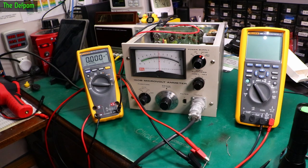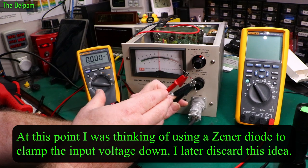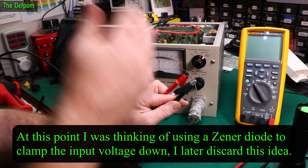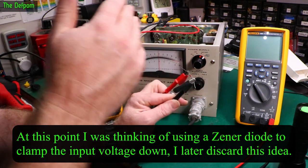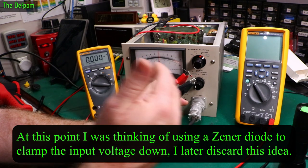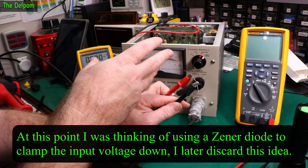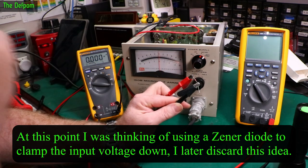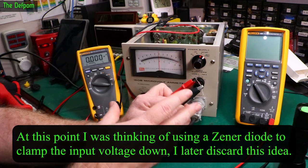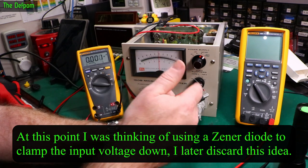And I probably can. I want to cap that voltage so it's a safe voltage for the voltage regulator I end up using. I'm going to use something like a 7909, and that can then drop that voltage down from like 30 volts or so down to 9 volts. Now, those regulators can't handle too much input voltage. I don't like it. So the 37 volts or so that we're getting floating in the circuit here would be bad for it. It would likely blow it up. So if I get down to about 30 volts, that'd probably be okay. I was thinking 24 volts because this is a Zener I've got, it's 24 volts. But that's probably too much still.